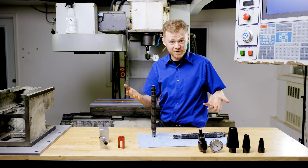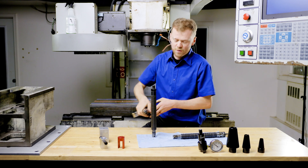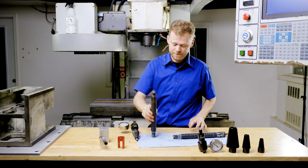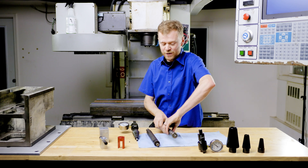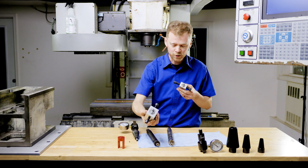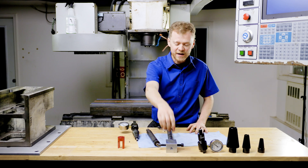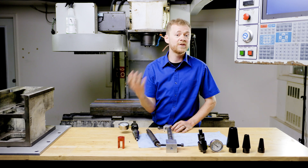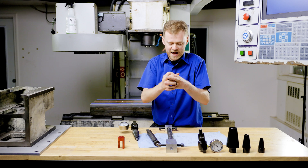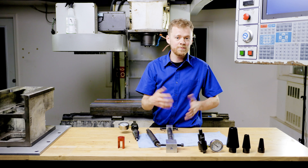So what do you do if your drawbar is bad and it is reading low? Well, you can replace the drawbar or we offer a rebuild kit and the tools to do it. I built the tools and I built the rebuild kits and I've done a bunch of these. If you have a super speed, you're going to use these two tools that will fit over it. It will clamp it — you'll hold the bottom one in a vise, you'll put an impact wrench on the top, spin it off. You can get a rebuild kit with the washers. You're going to sand the shaft down because the washers kind of chafe the shaft. Stack all the washers back up, impact it back down, and you have a rebuilt drawbar.